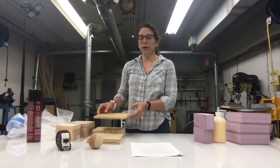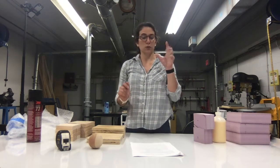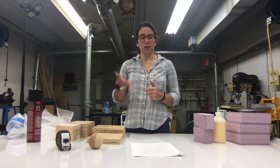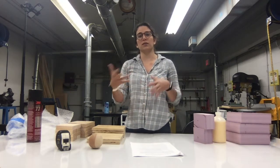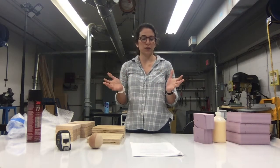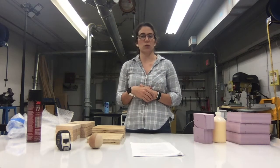Be sure to buy a high quality plywood, like from grade A to C. The importance is that the higher quality plywood uses a higher quality glue for the interior of the plywood, which is a little bit more resistant when the crate is exposed to water or any other material, so that the product is safe when it travels to wherever it's going.